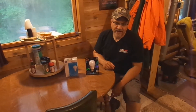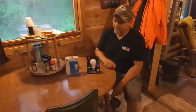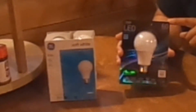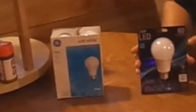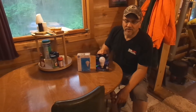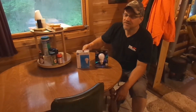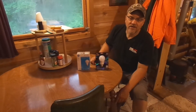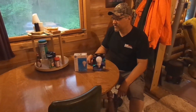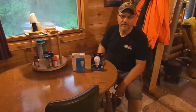Here's a new-technology way to save a lot of energy use from your battery bank — going with LED bulbs. As you can see here, this is a 60-watt equivalent but it really only uses 9 watts, where these old-style 60-watt bulbs actually use 60 watts. These bulbs are 840 lumens, and this one is 800 lumens — very similar. But this LED bulb only uses about one-sixth of the energy. That's going to save a lot of load on your battery bank, especially if you put them throughout your off-grid house or camp.